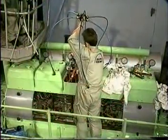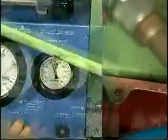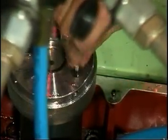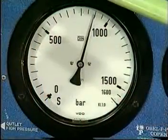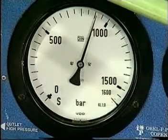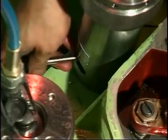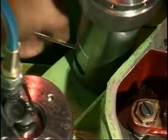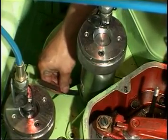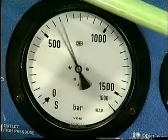Connect the hydraulic high pressure pump and vent the system if necessary. Tighten the venting screws when oil without air bubbles is emitted. Increase the pressure to the prescribed value and tighten the nuts with a Tommy bar. Check with a feeler gauge inserted in the recess of the spacer that the nuts bear against the contact faces. Relieve the system of pressure.